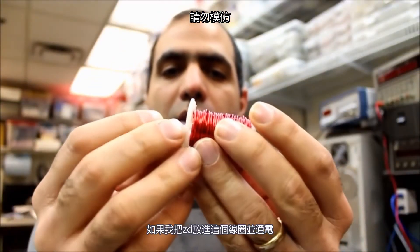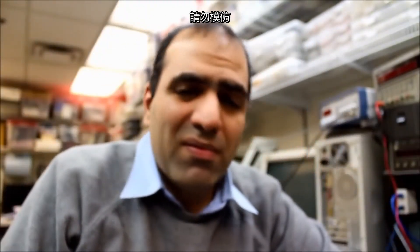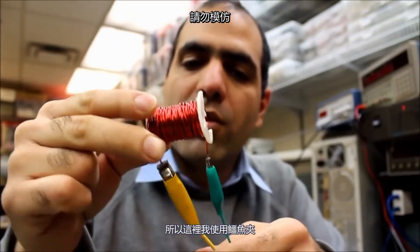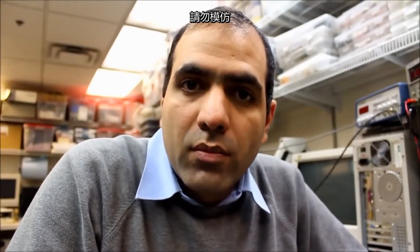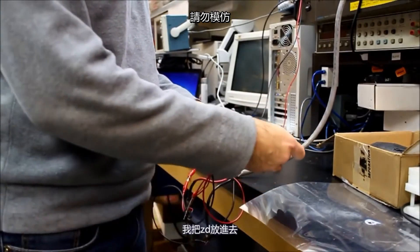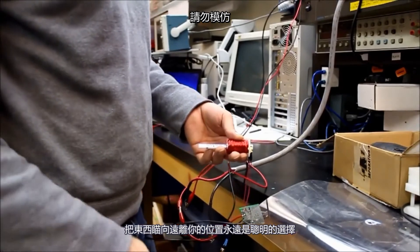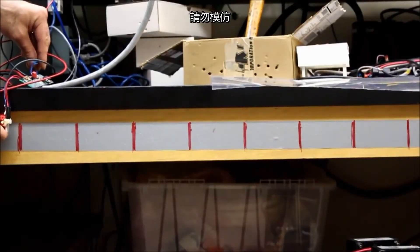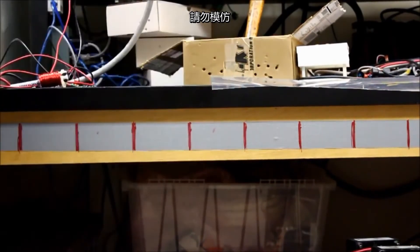If I put the bullet inside the coil and try to turn it on with the power supply — it's always safer not to work with live loose wires, so instead I'm using these alligator clips here. There you go, you saw what happened. Always make sure the wire gauge can handle the high current — you can see the oscillation I was talking about. So say hello to my little friend. I put the circuit together, put the bullet in, and there's a switch that acts like a trigger. It's always wise to aim away from yourself. The circuit blew up but I measured the speed to be close to 25 kilometers per hour, or 16 miles per hour. Thanks for watching.